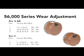In dynamic stopping applications, you will see some level of friction disc wear. As the friction discs wear, the air gap also increases over time. The amount of friction disc wear and increase of air gap will vary based on certain variables such as inertial load and cycle rates. When the air gap reaches the specified maximum limit or above, it needs to be adjusted back within the factory specified range. These ranges vary based on the number of friction discs or torque rating of the brake.